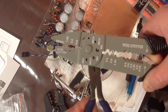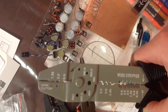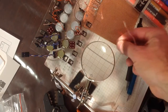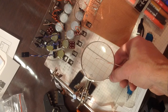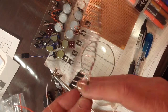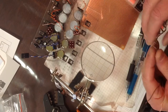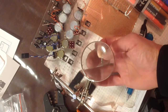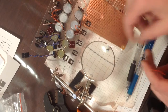Now, you could put this all in a solder setup and hardwire everything and be frustrated afterwards when you find that things aren't working and then you have to desolder. So doing the Molex is easy, simple, and very flexible, keeping troubleshooting down to a minimal, because if you have to desolder something, you could end up creating other problems in the process when you're troubleshooting. So pulling out a connector and reversing pots is fairly easy with them all connected with Molex.